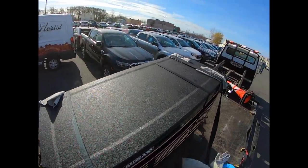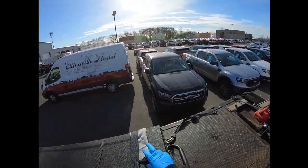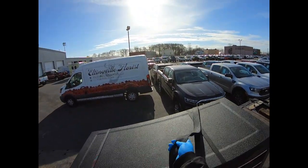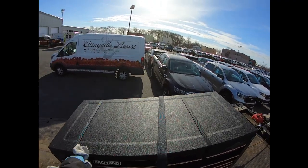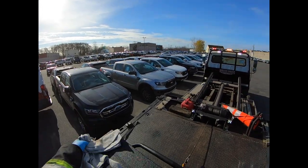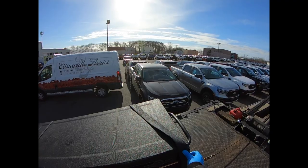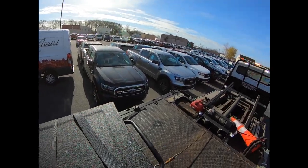In this case you can, because it's strapped down that way anyway. It's secured the other way around. But you never want to put one single strap right here, because you'll bend this down and then you'll have an issue with the customer. So always try to keep it like this, or like I said, you can go even right up to this corner, because this is the strongest part.